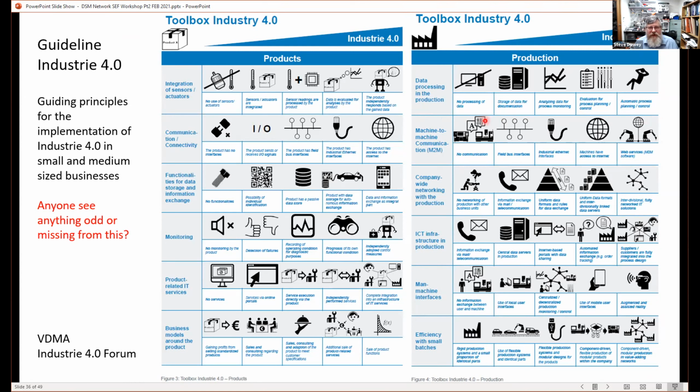And that's essentially where the Smart Enough Factory comes in. What the Smart Enough Factory is talking about is where we don't have a fully ISA 95 described production system, where we possibly wouldn't introduce them in the same way as the model being shown, but we would still want to get information from our production system, and we don't have to build it into the production system itself. We could build it into a supplemental system.